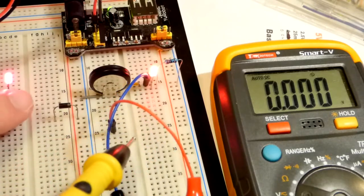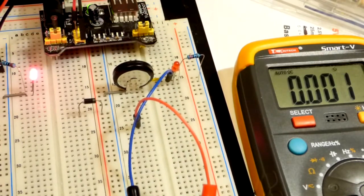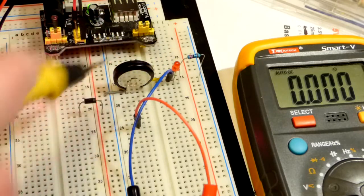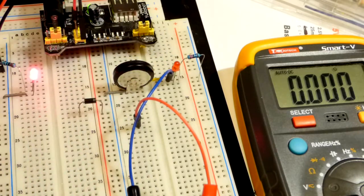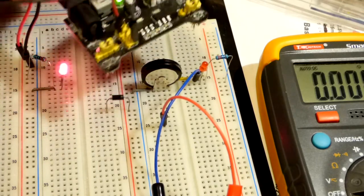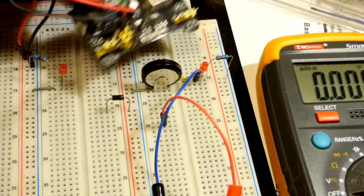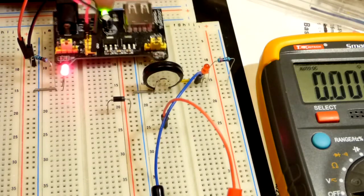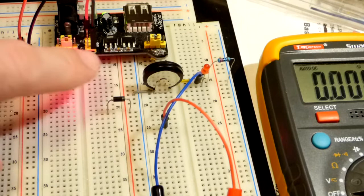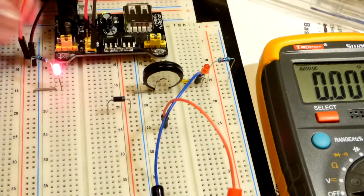Even though this is disconnected we can still power over here. Now if I pull this out of the breadboard we don't have to worry about short-circuiting anything other than ground to ground, because all the grounds stay connected. Once we remove that, the supercapacitor doesn't have a place to discharge. The main thing is those pins that stick out - we can power other stuff even if this is not in a breadboard, as long as the supply is on it will provide power to those wires. So if you're wondering about those pins, it makes an easy way with female to male jumpers to power something else.